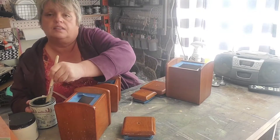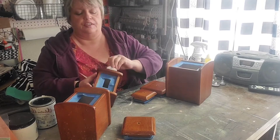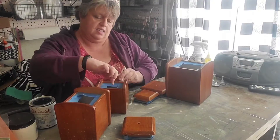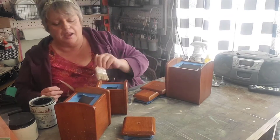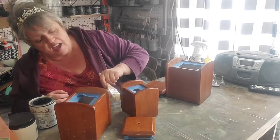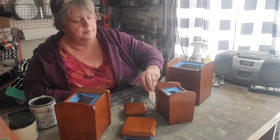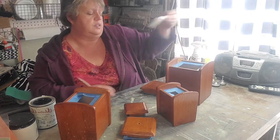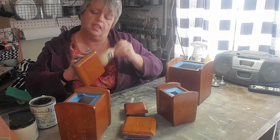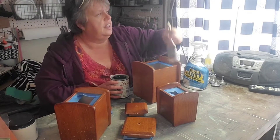So I taped it up so there's no question. Now I'm using a DIY Salvation solution and clear coat so that none of the tannins in the wood will come back up through, because we'll be using a white paint and I don't want it to turn yellow — this acts as a barrier in between. Typically this stuff goes on very smooth, but in this case it did bubble up some due to the fact that there was some kind of oil-based finish on the original canisters. So we're just going to work with that texture today. I don't want to sand because that would break the seal already on the canisters and we'd definitely end up with tannins rising up through the paint.